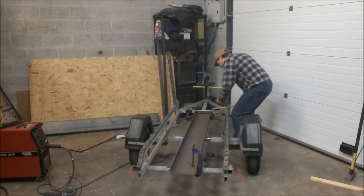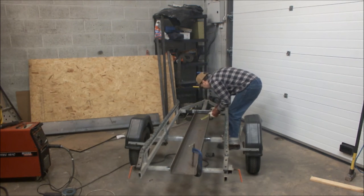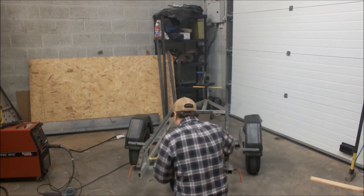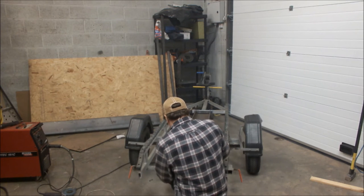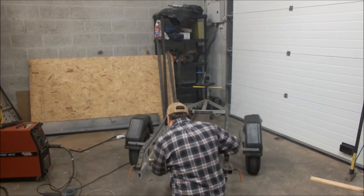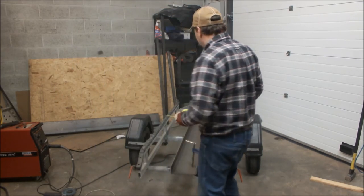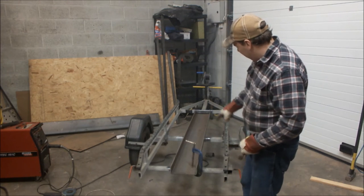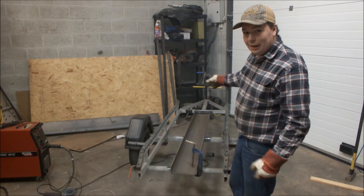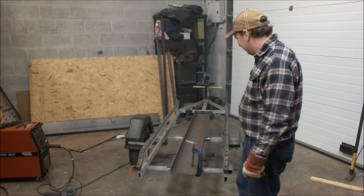What's that old saying - think thrice, measure twice and cut once. Perfect - we are in the middle, that's actually spot on. As you can see there, the axle and this back cross member are level but the one at the front steps up. It's absolutely fine, I'll just run a weld around it. There's going to be something on that end anyway for a wheel clamp to hold the bike in place. So the next thing we're going to do is fire up the MIG welder and see if we've got all the galv off.